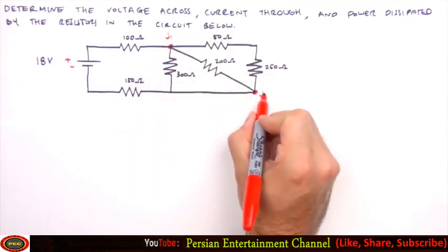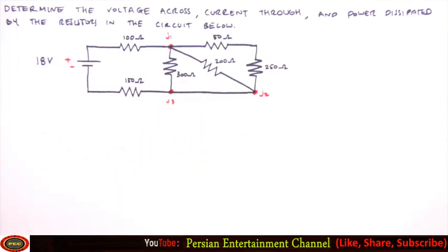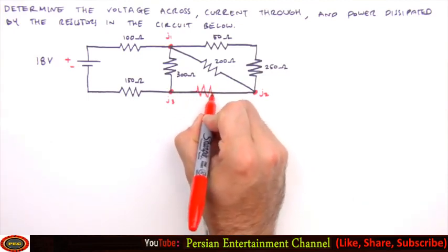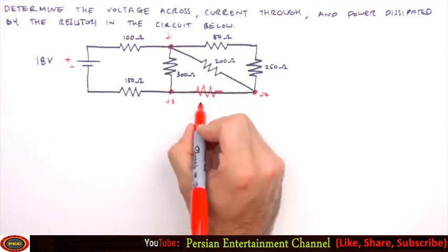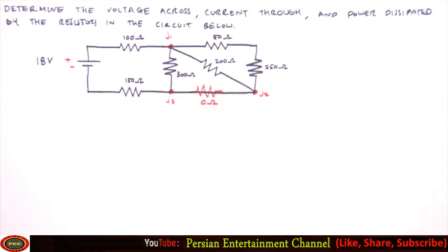If we had more room on the circuit diagram we'd also label the unknown currents, but we'll come back to those in a little bit. Before we take a crack at this circuit, I recommend that we replace this empty leg with a dummy resistor — a zero ohm placeholder that will make our analysis a little simpler. This step isn't necessary for seasoned veterans, but I find it helpful for beginners.